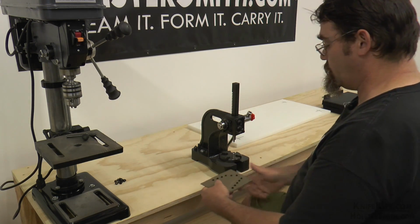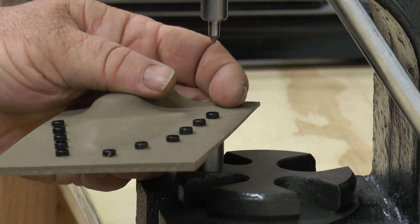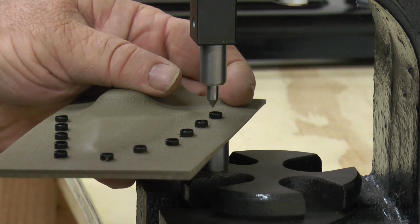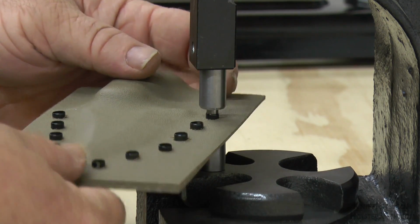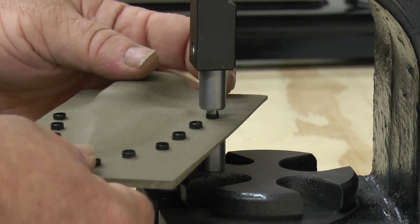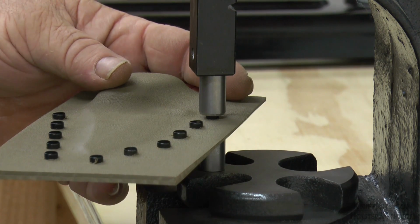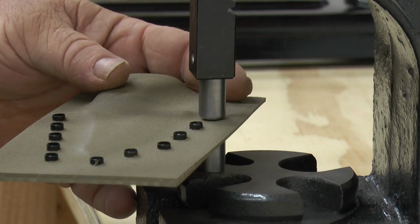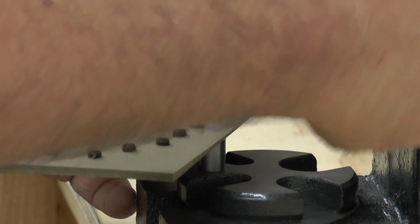So when you bring it over, you set the pre-rolled side down on the die and get it all happy. And then you bring the top part down with the spike on it, and you use that to get everything aligned. Now, you can see the handle going down, means everything's getting aligned. Now that everything's lined up, I'll just apply a little bit of pressure, not much. See, I'm just doing it with the ball of my hand. And you'll feel when it stops. And don't go any more. Just go ahead and ease that up.